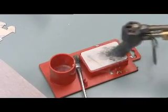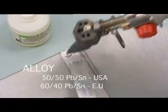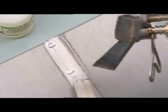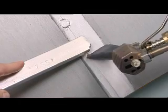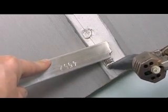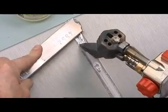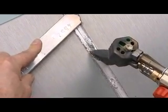The tin soldering stick or soldering metal consists of an alloy of lead and tin. Tacking makes it possible to join the two pieces so as to obtain perfect capillarity. Tin the tip of your Express iron carefully, take a drop of soldering metal with the tip and apply it to the desired place on the VM zinc. Let the soldering metal penetrate the zinc to create a soldering spot, and maintain pressure with the soldering stick until the metal cools down.